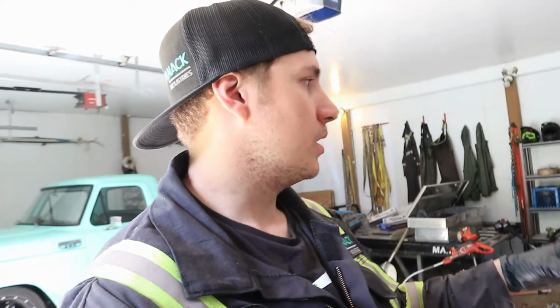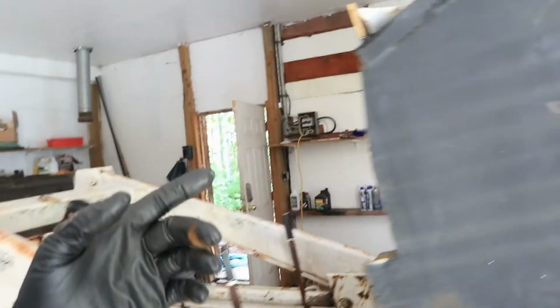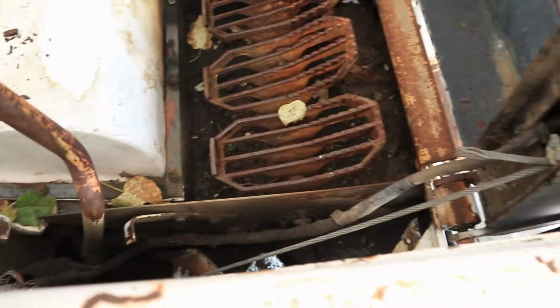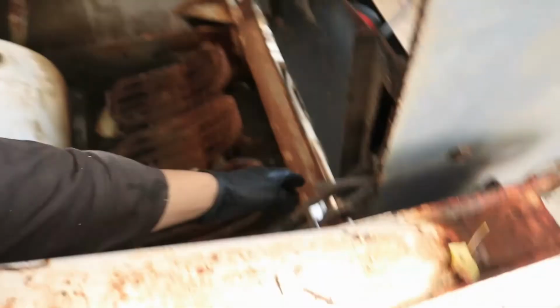She's ahead. Now, this is my first time flipping this one ahead. Like all the newer ones, they have a little gas shock to help control it. This one doesn't. So I went to one of the support beams there, using this eyelet here, pulled it ahead, but once I was ahead, I wasn't sure how far this was going to come. So I put a strap to the back there, just so I could control it going forward. Eventually, I did see that there is a cable here. Now, whoever did this, this is aftermarket. So I'll probably put a strap from there to there, because I don't want this falling. I don't want to wreck my cables.